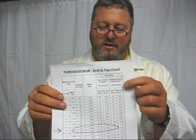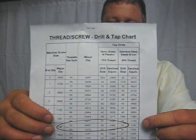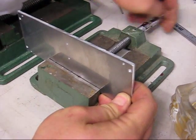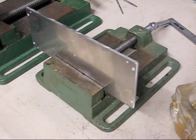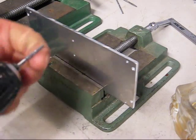But if you don't have the drill bit, you don't know what size to use with the tap — you can actually look it up on the internet. Just find a chart, look at the screw size you're going to tap, and you can find the diameter of the drill you're going to use. So it's pretty straightforward. We're going to secure the workpiece here in the clamp, nice and strong, and set our direction to clockwise.